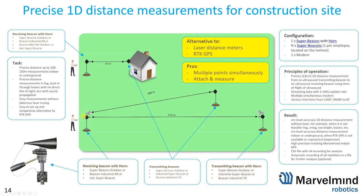You can access this data via various interfaces — from UART to virtual COM port over USB, RS485, Bluetooth, and multiple other options. You have the same super beacons usually in outdoor configuration because you are outdoor: the receiving part is the horn, and regular super beacons outdoor serve as transmitting beacons.